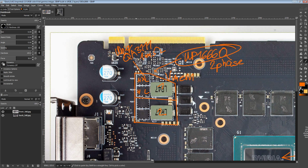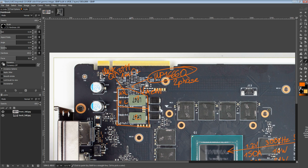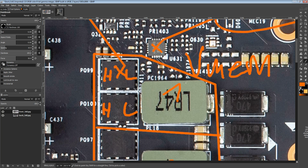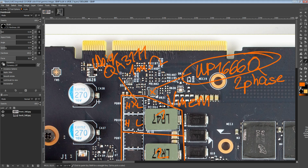And the funny thing is, the main reason I think MSI is bothering to use these is because MSI uses them on other products, because otherwise most of the time you would just use the same parts everywhere. So I was really surprised when I noticed, look, there's the Ubiq logo. These aren't the same Fairchild dual NFETs as the other ones, because it's a cost saving measure here.